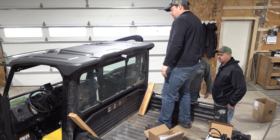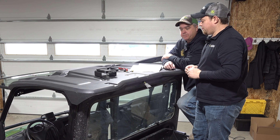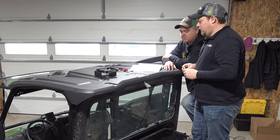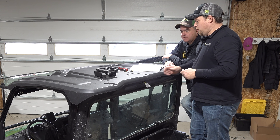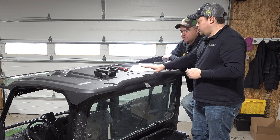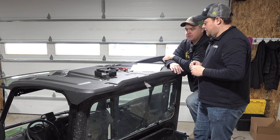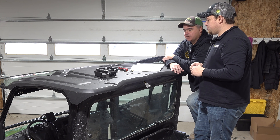So there are plugs here — kind of a pre-dented place for the mount, molded right in there. What we have are some self-tapping studs that we're going to put down in here. We'll use a little adhesive, and then our mount is actually going to mount on top of this. Normally in the kit we would have just the square, but I've put together the riser kit to come up above the cab so that our globe would sit forward-facing instead of rear-facing. So we're going to spin the globe around from how the typical Deere approach is. That'll be for some functionality and make it easier out in the field for setup. So it's going to be facing forward.